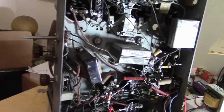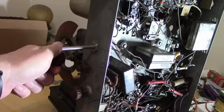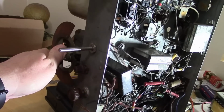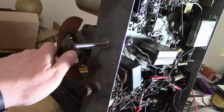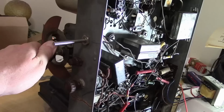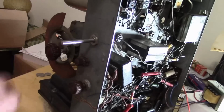But it needed to get done at some point, and that area kind of bothered me, the way that it was kind of hacked up. It is working the same as it was before. We still get the volume all the way down, but now we get some weird motor boating humming between stations. That sounds fine when I'm on station. It could be something to do with the AVC.